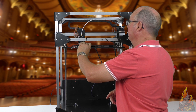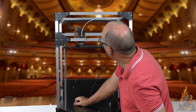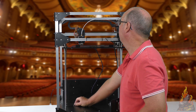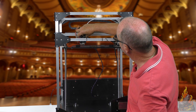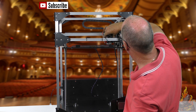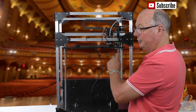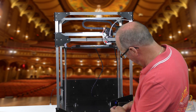We check the front and we're tight there as well. So at this point we can just drop the bed on one side a little by using the motor just to get our side-to-side right — which is what I do. Some people say it's not the right thing to do but it's what I do. You can lift that one up just a fraction. Okay, so it's level side to side. So now we can home again.